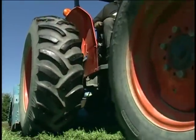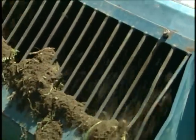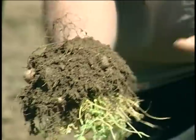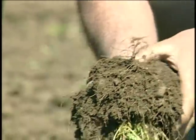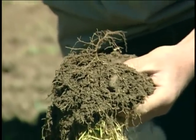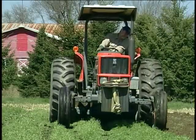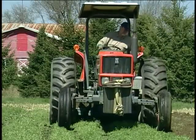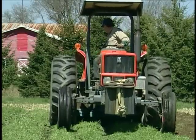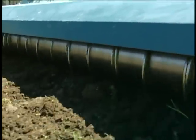The action of the spades is actually very slow compared to, say, a rotavator. A rotavator moves at high speed and it would destroy the aggregation of the soil. What it does, it leaves the soil in very large clumps. This is like one clump where you can see that not a lot of damage has been done to the natural structure of the soil. So the whole idea is that we want to have an inversion, we want to incorporate, but we don't want to destroy the aggregation. And this is possible with the action of the spader.